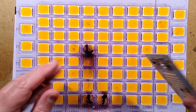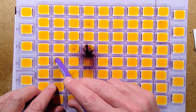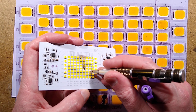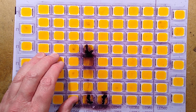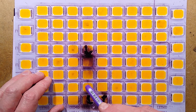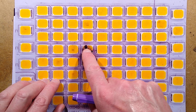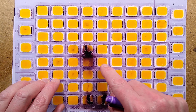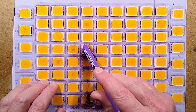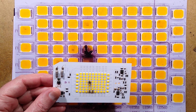The fact that there's an aluminium substrate is part of the issue. You can see damage in multiple LEDs here — they've been baked. The phosphor-loaded resin, whether it was originally gel or hard, is hard now. What can happen is cracks form, and the thermal expansion, contraction, and cycling cause the internal bonds to snap off, leaving an open circuit. Because these operate at quite a high voltage, that open circuit has high voltage across it, and you end up burning a tracking arc — a really major issue with aluminium-substrate PCBs.